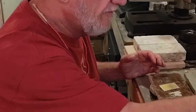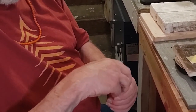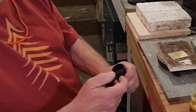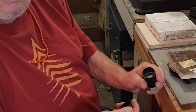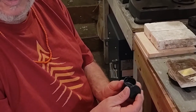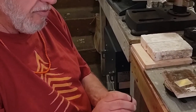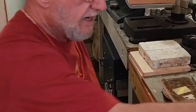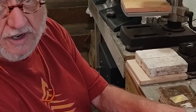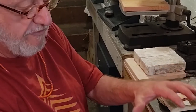I have different kinds of solder, little tiny pieces of solder, and what I do is I will paint this with white flux — that's what we call it. All it really is is borax and suspended gritty glass, and when you melt it, it actually becomes a sheen of glass over the top of the solder, so it keeps the metal from oxidizing before the solder melts.